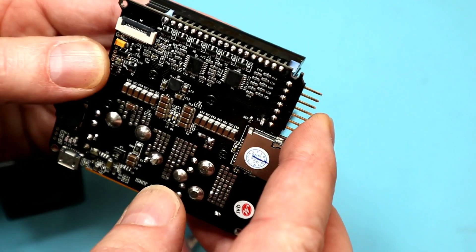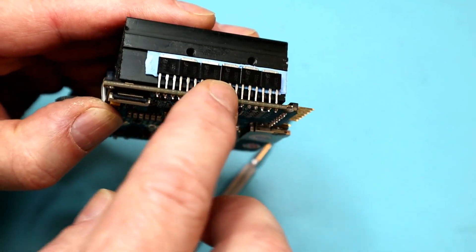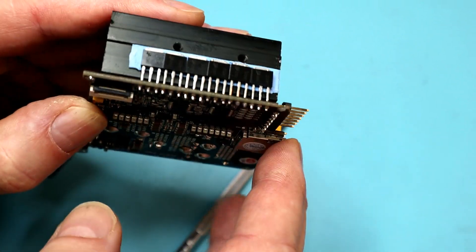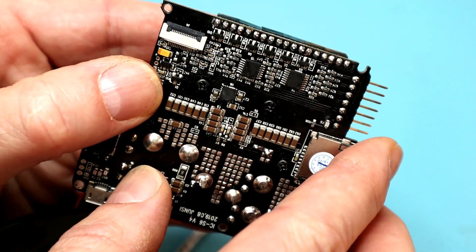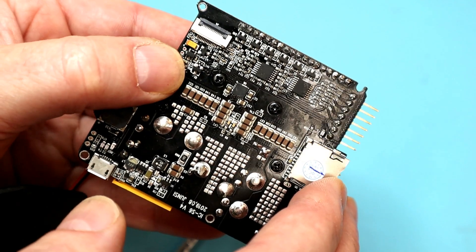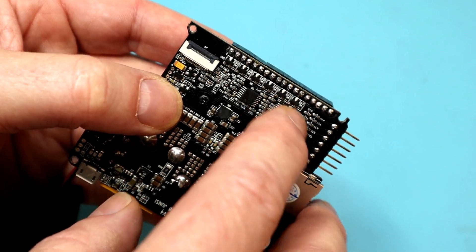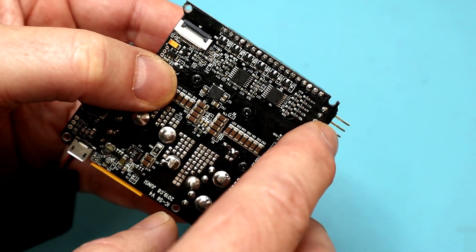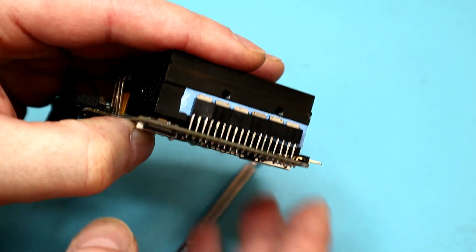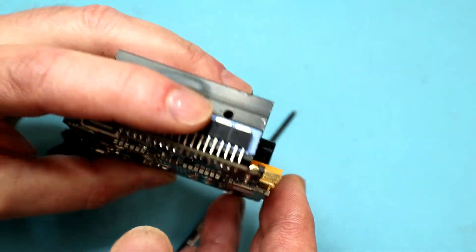Here's the balance input. You know what — they're not even using resistors. They must be switching the cell right to ground. So these would be considered power transistors because they're carrying quite a bit of current — two amps is what it's rated at. And they're actually being controlled by these little switching transistors. In other iChargers I've pulled apart, there've been little switching transistors that close the circuit between the balance lead and a big resistor or array of resistors. But here they're using these transistors as the resistance source, probably just pulsing them to vary the load.